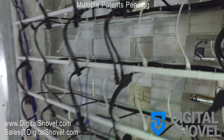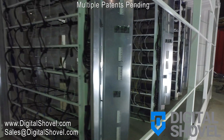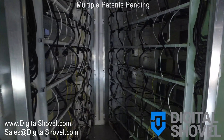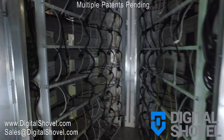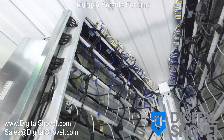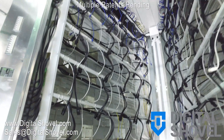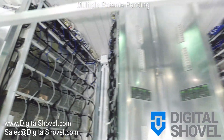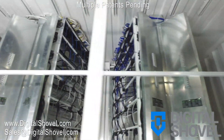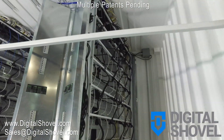Our new PDU designs are actually going to have a C19 outlet with a UL approved splitter that allows you to break that into two separate C13 outlets as well. At the top of the container, you can see here all of our network cabling is in the racks. It is all pre-labeled on both ends so you know exactly which cable goes to which miner. It really makes deploying easy. We could also add layer three switches if our client desires that.